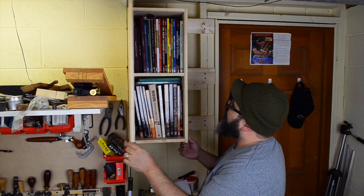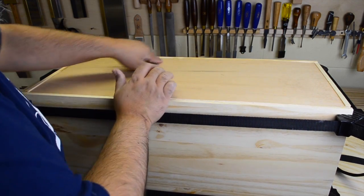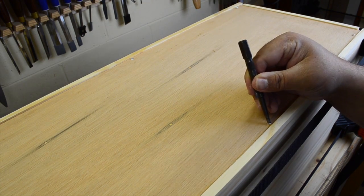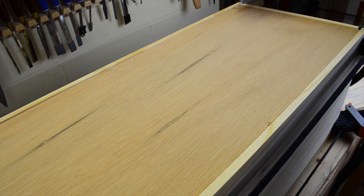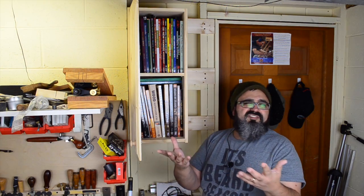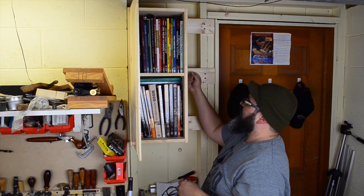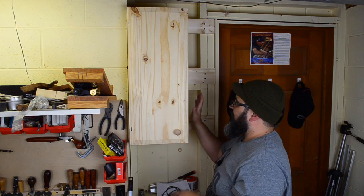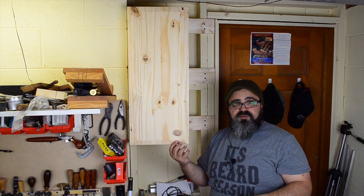We're almost completely finished building this little small pine cabinet. The only thing I needed to do was to drop the back in — in this case, I'm just using a quarter-inch piece of plywood for the back. As you can see, just drop it right into position. This is going to help to maintain squareness just in case it is off a little bit, though because of that blind rabbet joint, I'm not too worried about it. To get that in position, I just simply took some scrap nails and toenailed those into position to make it really, really strong so it's not just going to simply pull away. In the future, if I were to build another one of these — which I just might do, because I really like the size and the versatility — I might use something a little bit thicker, either scrap material from the build itself or maybe even some half-inch plywood, just to give it a little bit more strength and peace of mind when attaching it to the wall. It's really, really rigid and quite in place.